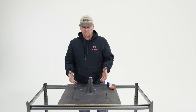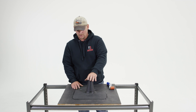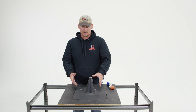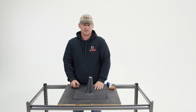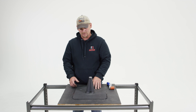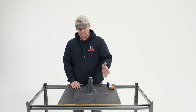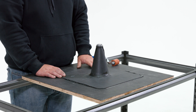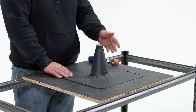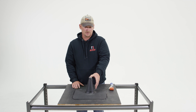And that's pretty much it. It really is that easy. Like I said before, it comes with the tape pre-attached. You just mark it all out, prime it, stick it down. These are great time savers. If you would have to field fabricate this, it would just take an exorbitant amount of time. I've been on jobs where there's literally hundreds of these, and this streamlines the whole process. It cuts man hours — drastically reduces man hours, and potentially days. And that's how you install the EPDM flashing for the Quick Mount PV's base.